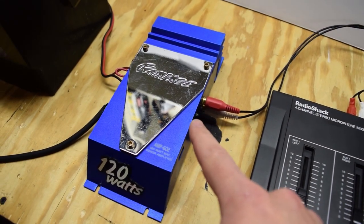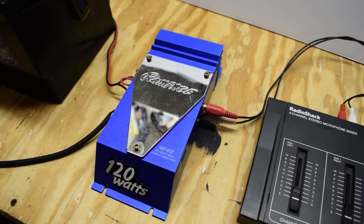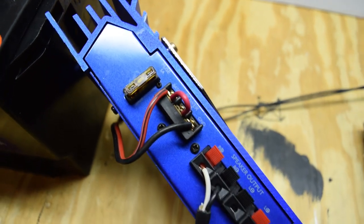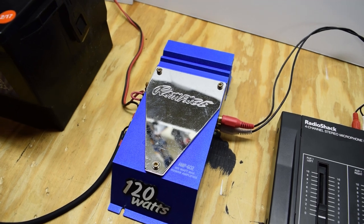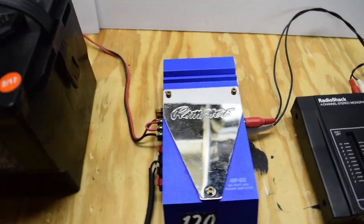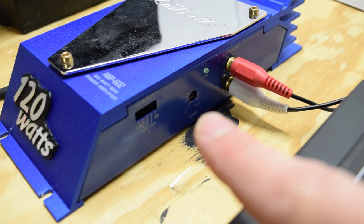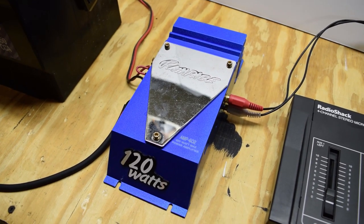The output of the mixer then runs to the input of a car amplifier. You don't necessarily have to get this exact amplifier, but pay attention to how much power it needs to draw. This amp has a five-amp fuse, so it won't draw more than five amps — really suitable for what we're doing. It's 120 watts across both channels, so 60 watts per channel, and realistically that's probably only 30 watts RMS per channel. We're only running one channel of audio, so we're probably only going to be pushing 30 watts RMS, 60 watts peak. It has speaker outputs, power connections, a gain knob, a power LED, and RCA inputs. The client picked this amplifier up used for $20 on Craigslist.